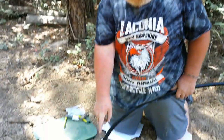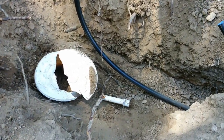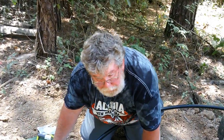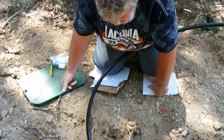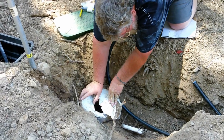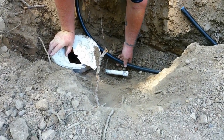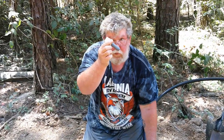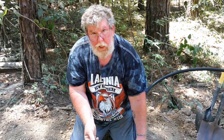We're at the water supply. If you look down here, you can see that PVC pipe coming out from under the bucket. Inside that bucket is another shutoff valve. When the guy who put the septic put the frost-free in — that was only two weeks ago — he put this bucket in over our last shutoff valve. He could have just left this all exposed so I didn't have to dig it up, but it is what it is. So I'm going to reach down in here, mark this black line right there, cut it, and put this barb with this PVC fitting on it, clamp it on, and then glue it to my supply line.